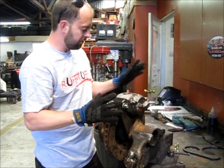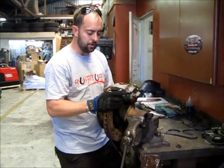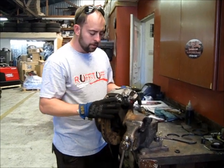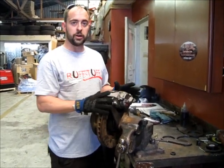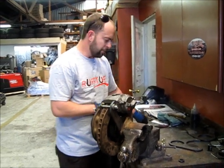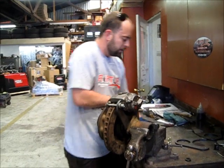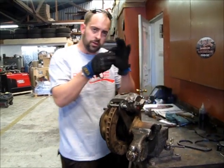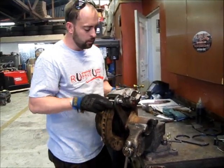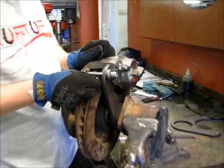The next thing that Dan likes to do — in a lot of applications, this might not seem straight on there. If you don't have access to air, this is how you're going to make this thing level. A lot of times you hear about using nickels, but on this application that doesn't exactly fit, so we're using a couple of washers placed underneath the slider here to get everything true and flat.